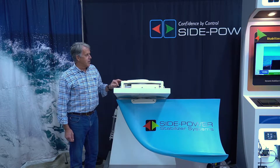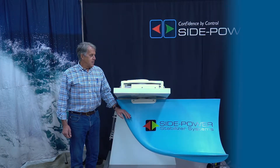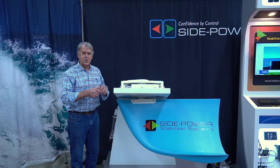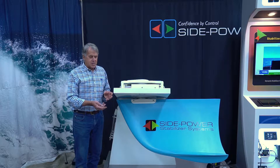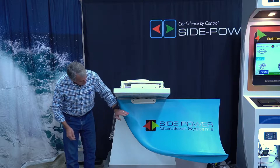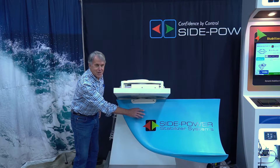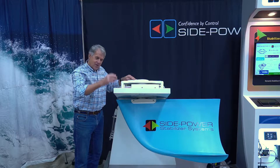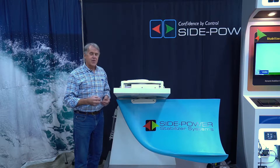It's a rack and pinion style actuator, and here's our vector fin. The rack and pinion actuator is used for the two smallest size fins, and then we have our more standard double-cylinder yoke-type actuators for the larger fins. The installation principle is the same, but everything is kind of flipped upside down with the larger sizes. The vector fin has the shaft embedded in the foam-filled fiberglass-covered fin, and the shaft sticks up out of the fin. With the larger sizes, the shaft is actually part of the actuator — it protrudes down and the fin slides up onto the actuator, so it's sort of reversed. But the principle is the same.